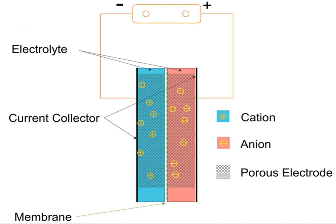Lithium-ion capacitors with doped electrodes may reach a rated voltage of 3.8 to 4 volts, but have a lower voltage limit of about 2.2 V. Operating supercapacitors below the rated voltage improves the long-time behavior of the electrical parameters. Capacitance values and internal resistance during cycling are more stable, and lifetime and charge-discharge cycles may be extended. Higher application voltages require connecting cells in series. Since each component has a slight difference in capacitance value and ESR, it is necessary to actively or passively balance them to stabilize the applied voltage. Passive balancing employs resistors in parallel with the supercapacitors. Active balancing may include electronic voltage management above a threshold that varies the current.